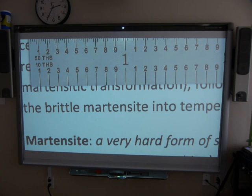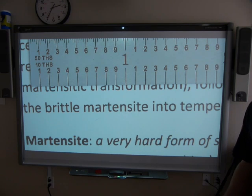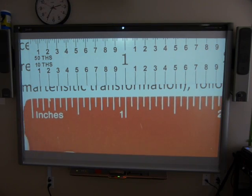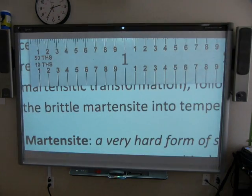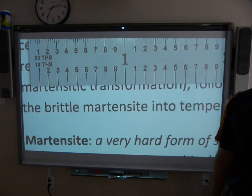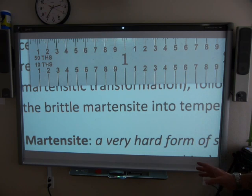You can see that the whole inch has been divided — instead of 16, 8, 32, 64, or 128 parts — into 10 parts. Here's a standard ruler next to it. You can see one inch there, and on the decimal ruler you have 10 parts to an inch, so that could be 0.1, 0.2, 0.3 — or 1.1, 1.2, 1.3, 1.4 inches. There are no traditional fractions; these are decimal fractions, no usual fractional imperial ruler markings.